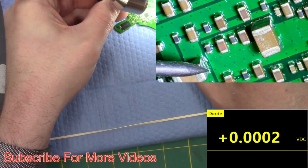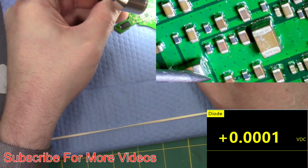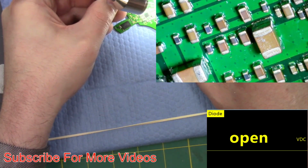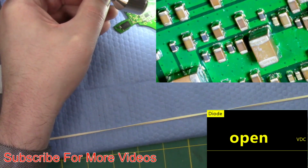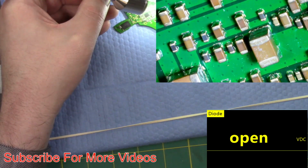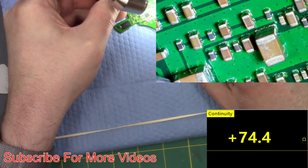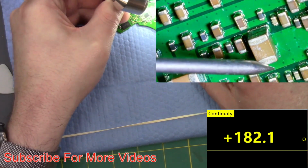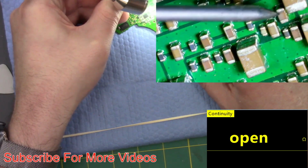Okay, that's interesting. That capacitor is, oh no, that's not. Let's see what it is in continuity mode. I normally work with ohms. I'll check out. That actually might be a low resistance to ground. Yeah, 74 ohms. That could be legitimate.